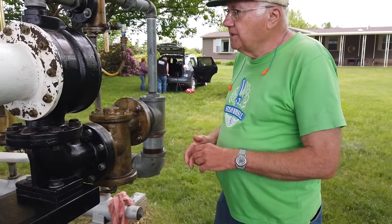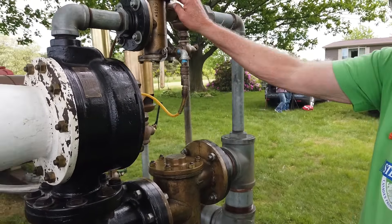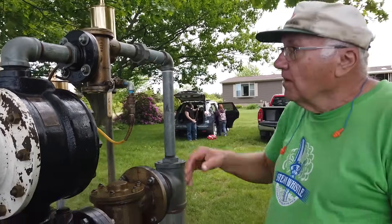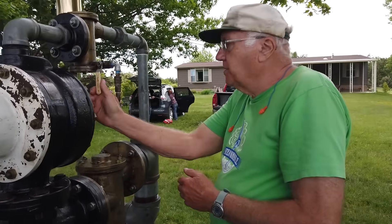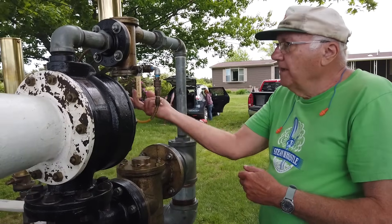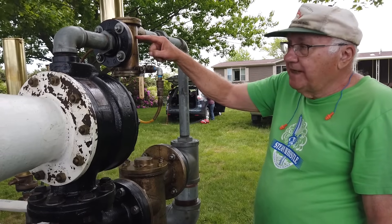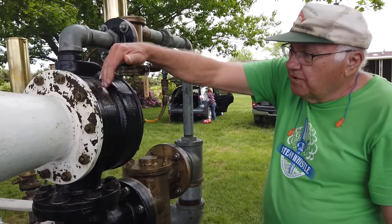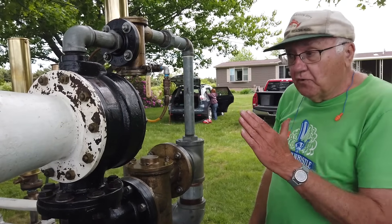The way it works is like this. This is an inch and a half automatic valve called the motor drive. When this is pulled up, it enters air into this inch and a half valve and a piston pushes the main disc off the seat and allows air flow to this motor drive. The motor drive drives the piston back and forth, but no noise.